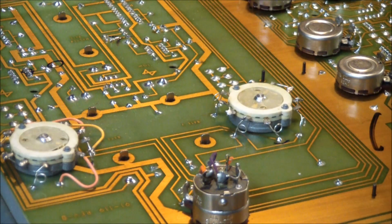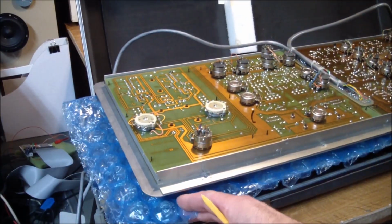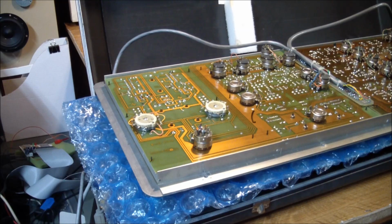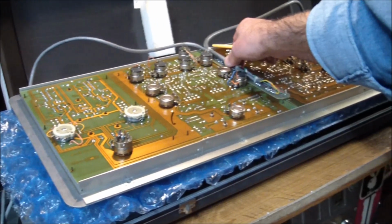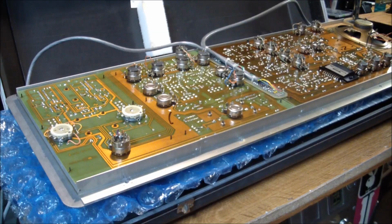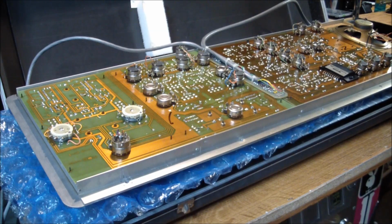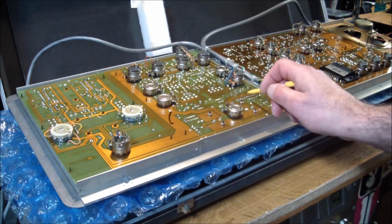And as I was taking things apart, I was just looking at it. It's insulated because I got this bubble wrap, which, even though it's blue, is non-conductive, laying here. So I turned the machine on, had a look at this connector over here, which is held in place with two small screws. And I started measuring voltages, to see if the unregulated came in over here, and it gets regulated. The regulators sit under here. They're these two.